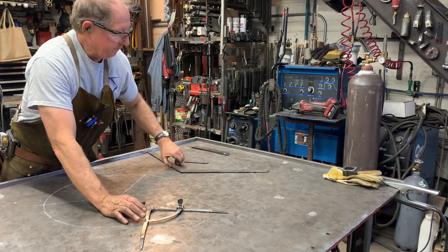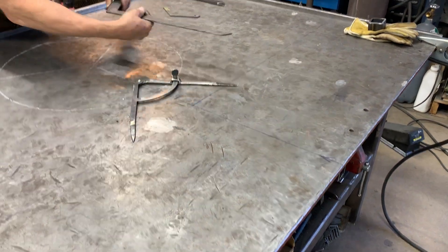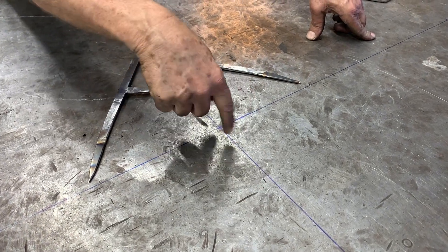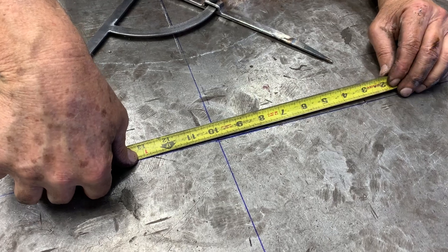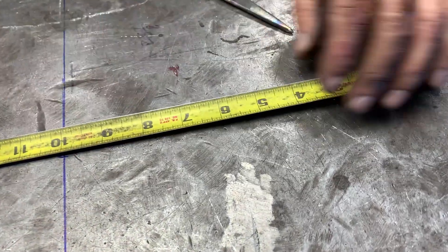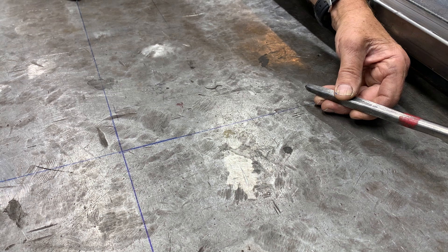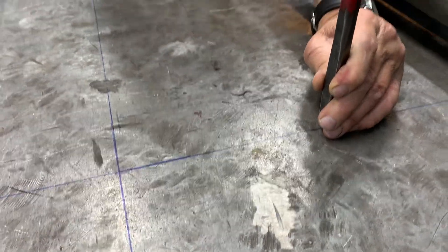So we want to make our 120-degree square. The way I do that is to use a little bit of geometry. I have a line, and I've placed a perpendicular line — it doesn't have to be that long. I measured from that point, put my tape on 10 and marked over to 3. The distance doesn't matter; it just needs to be the same on each side. Then I make a small punch mark the same distance on each side of the perpendicular line.